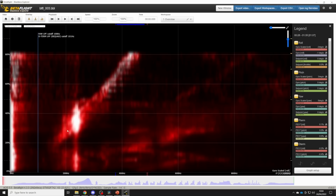And we can see now that we have a nice sweep of motor noise here and a second harmonic of the motor noise down here, and that we have one noticeable frame resonance on the AOS 5 V2, but critically it occurs above 200 Hz, so it's really easy to filter out with very, very minimal delay, and below 200 Hz the frame is incredibly quiet.